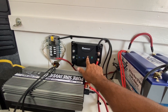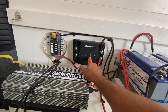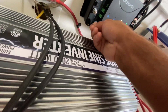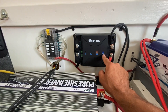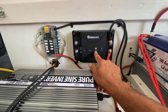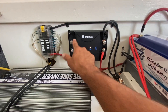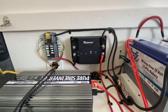There's a yellow light here — that's the type of battery you're using. Since I have lithium ion, I need to change this to blue. There's a little pinhole on the side which will change it. Blue means it's a lithium battery. Yellow means the voltage is normal. When the battery's full it will be green, but that won't happen until I connect the solar positive and negative and it starts charging, which I'm going to do now.